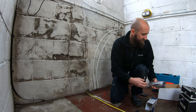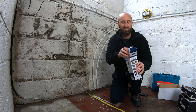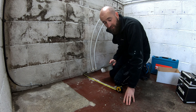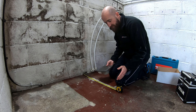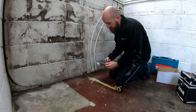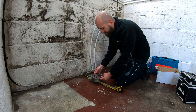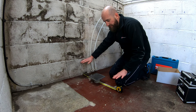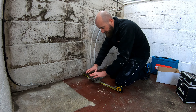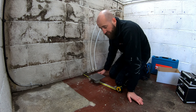That's 65mm, by the way — gives us plenty of wiggle room. The depth of this platform is going to be about 600mm, 60cm — in old money, 23.5 inches. And this will be sitting in the middle, with a little bit of a slope from either side coming down to it, from 100mm. I think that should be sufficient.